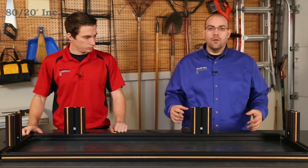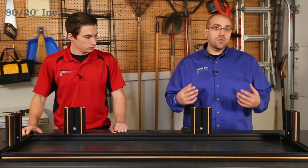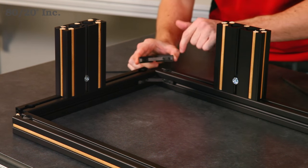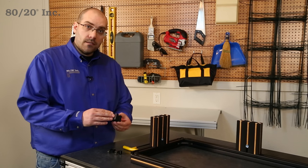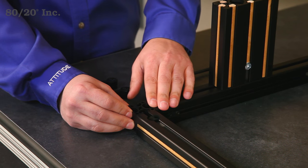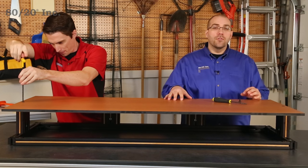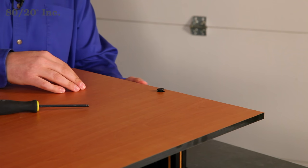When it comes to the top portion, we're going to be adding four legs — one to each side and two to the back. These legs will act as a riser to give us some extra storage space. While Phil's tightening those down, I'm going to install some inside corner connectors to bring the whole frame together. You just put one half in each bar, get it in position, and tighten it down. For some extra support, we're also going to include these shorter corner pieces — we put them on the corner, make sure the top is flush with the surface of our other profiles, and join with an anchor fastener. We then secure the panel to the top portion by putting bolts into the countersunk holes of the panels and screwing those into the legs.